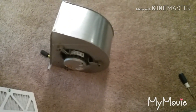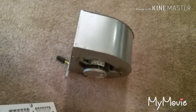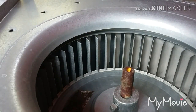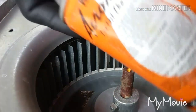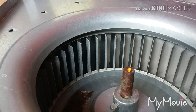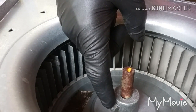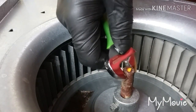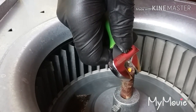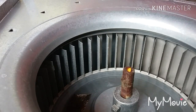The fan motor and housing is pulled out and sitting on the floor. I'm going to remove the motor and go get the new motor. The shaft has a little bit of rust on it, so I'm going to sand it with sandpaper and then apply some Kroil - you could use WD-40 or three-in-one oil. I'll take the set screw off, and then I'll hold the fan wheel still with my crescent wrench and work the shaft back and forth until it drops down through the wheel.